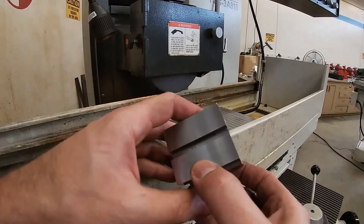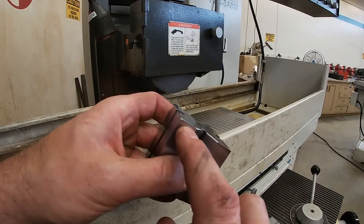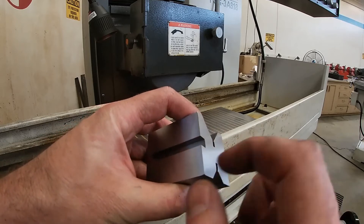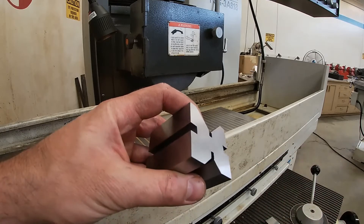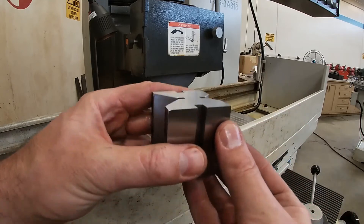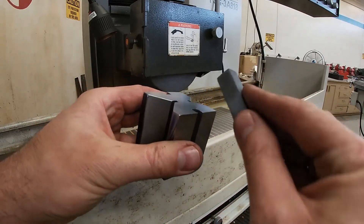So: ground surface, ground surface, ground surface. I put a big enough bevel on it when I was deburring that it's a very tight radius. But right here, these two surfaces have created as sharp a corner as you could hope to get — well, nearly. What you're going to notice is you think there's no burr. In reality, if I take a fine stone like this, come at a slight angle, and then start to roll it over — sometimes when you do that you'll get a very fine angel hair burr that breaks free.